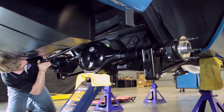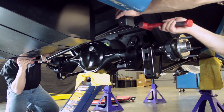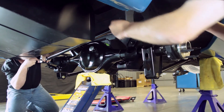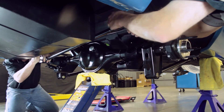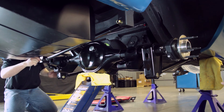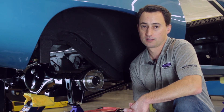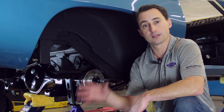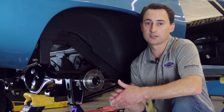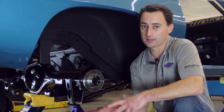With the track bar, we'll keep the bushing flange to the back of the car. We're going to locate it in our nominal ride height position in the lower hole on the vehicle side track bar bracket. The next step will be to install our JRI Detroit-tuned adjustable shocks. We're going to install the remote canister shocks into the DSC 69 Camaro test car; however, you can also get it as a base shock, single adjustable, or double adjustable. Then last, we'll install our DSC anti-roll bar into the vehicle.